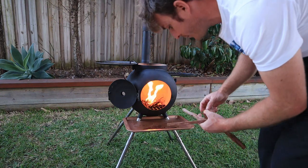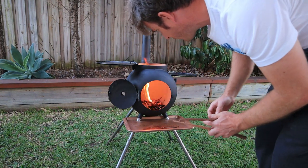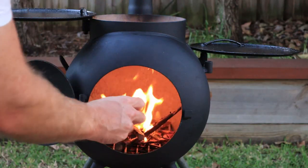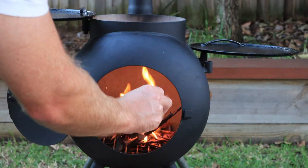If the stove fits, this heat curing can be done in your kitchen oven, but I simply reassembled my wood stove and fired it up. A small fire for about an hour should be sufficient, and after allowing it to cool, the paint will be fully cured.